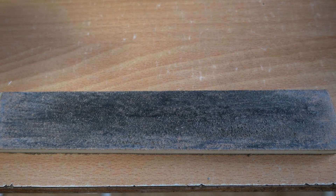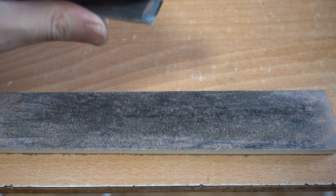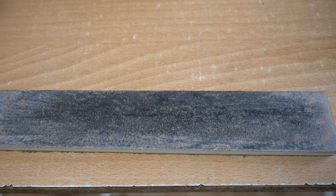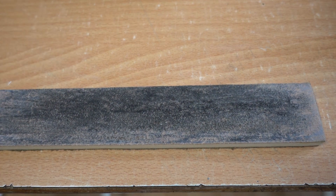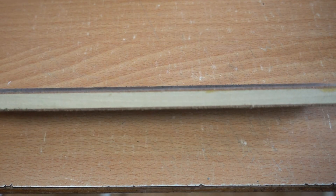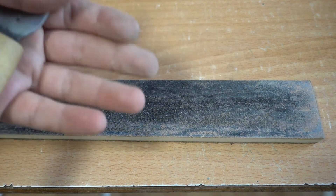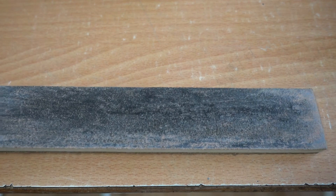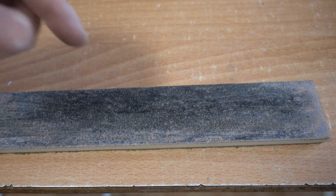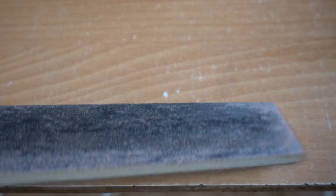For final sharpening this is stropping. After going with the 6000 you need to strop the edge to make it highly polished and extra sharp. I want to make a dedicated video about polish stropping and sharpening compound, but just briefly — this is wood with a piece of leather glued on both sides. The rough side should face you so the fuzzy side holds the compound. This rough side is around 8000 grit and this fine side is around 12000 grit.